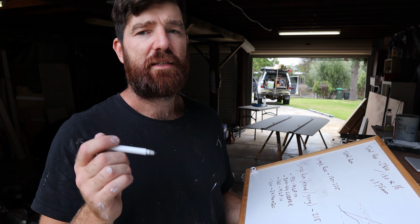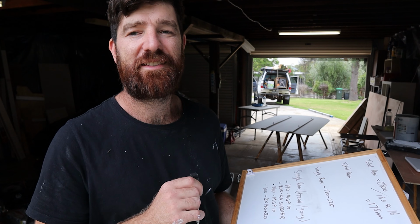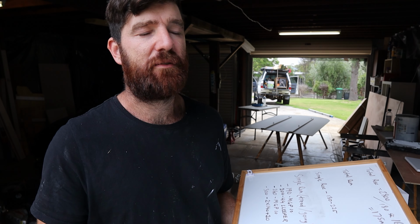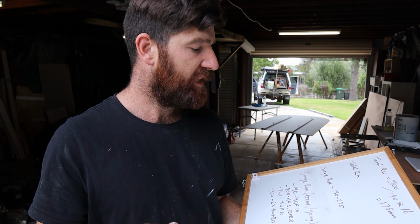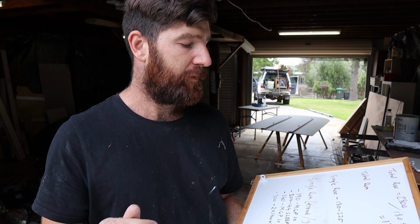So in Australia, it states that your going has to be between 215mm and 355mm. Now technically the stairs I'm building aren't up to code. I know they're going to be alright, they're only at my house, so if anyone falls down them, it'll be me. So I'm not worried about that. But this is information you need to know. So with that under my belt, I know my timber's 200mm deep.